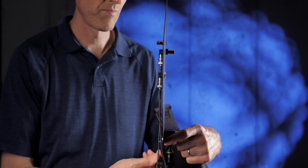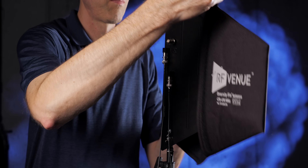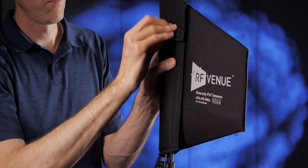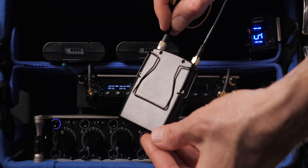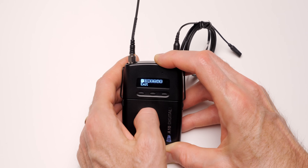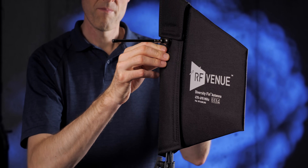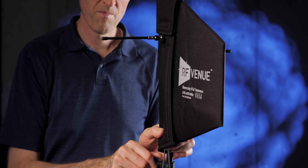The question is how well does it work relative to the included whip antennae with my Audio Limited A10 wireless system? We did two tests in the wide-open outdoors — one of the more challenging situations for wireless microphone systems. In the first test, we used the two included whip antennae with the Audio Limited A10 receiver. The transmitter was set to its highest output level, 50 milliwatts. The first dropout occurred at 25 meters with my body between the transmitter and the receiver. At 50 meters with my body between the transmitter and receiver, there were substantial dropouts, making the system basically unusable at that point.